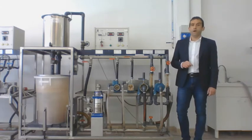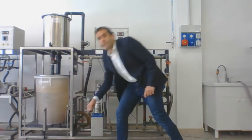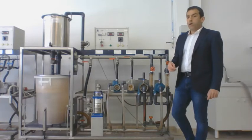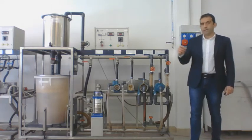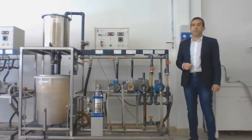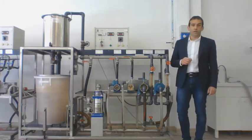You can also notice two more valves: one placed along the inlet duct, here, and the other along the outlet duct, here. Closing this last one, it is possible to modify the head provided by the two pumps and consequently the flow rate. The first one on the inlet duct is useful for inducing cavitation at the pump's inlet by closing it.